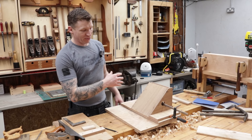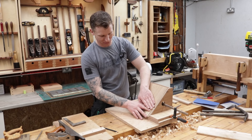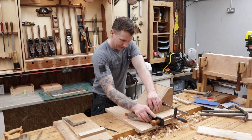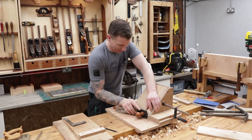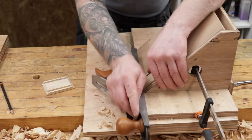We're set up with the miter jig — I have full videos on making all these jigs if you want to check that out. It's just a simple box at a 45-degree angle that holds our piece at 45 degrees to the plane. There's a fence to keep it square, and we can put little mitres in the end of each piece. What I'm going to do is establish a miter in the end of each piece and then make sure all dimensions are exact.